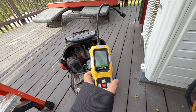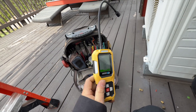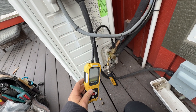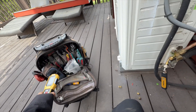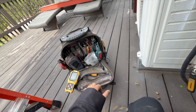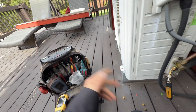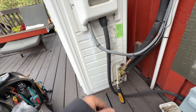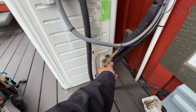This is the Forensics leak detector — it does A2L — the model number is FD-92. I've been using it for a while now and I will be doing a review on it. I like to use equipment like this for a long period of time before I really assess it. I got it during the winter so I wasn't doing a lot of refrigerant leak searches, but during the summer I used it quite a bit and I'm pretty happy with it so far. We're gonna start checking the coil and all the obvious positions to see if we can find this leak. It could have just been the Schrader core that leaked, and we'll check the service valves as well.